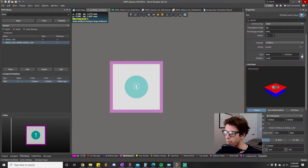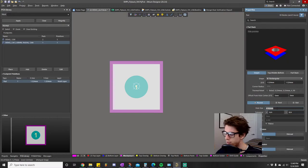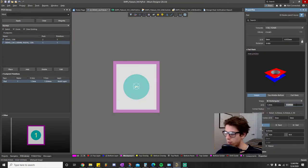Scrolling down to the hole size — let's go with 0.85mm, which is a pretty fair number based on my research. Next, we want to shrink the actual square pad size a little bit. Something like 1.3mm is the value I found; these aren't explicitly stated on the datasheet for the pad size, but we're using the datasheet to inform our decisions. So we'll set 1.3mm and make it a square pad.